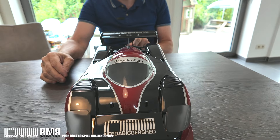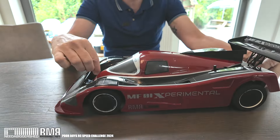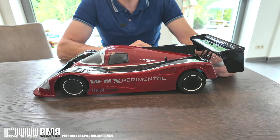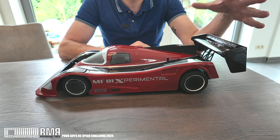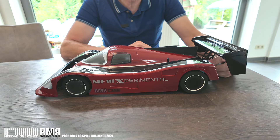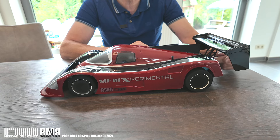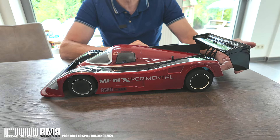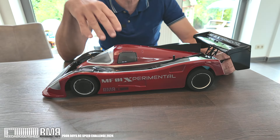I'm currently getting 53 kilometers per hour — about 33 miles per hour — and I'm hoping for 100 kilometers per hour. During the test run it felt very free-running and like it could achieve that. If I can get anywhere near that with confidence — since I'm not used to driving these things at high speed — I can start changing the gearing at the back with different pinions, and maybe even put a different motor in. I've got some other motors available but I won't go overboard.